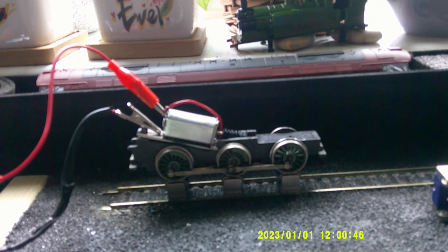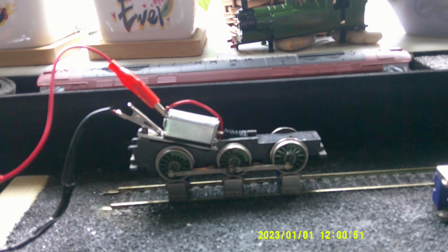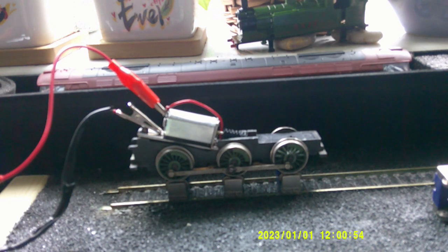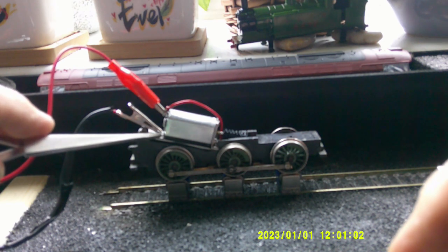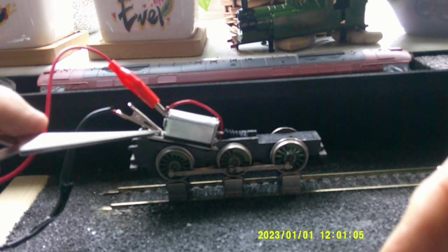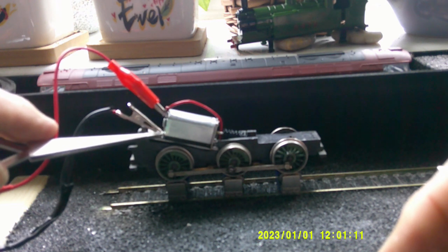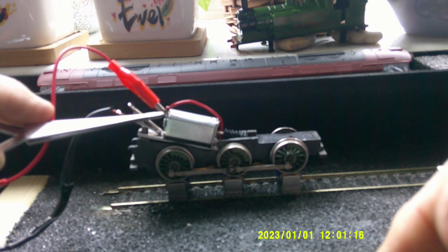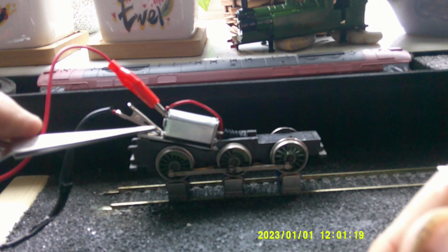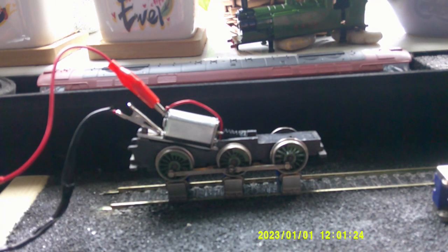I did get ahead of myself — I put it on the test track but forgot to switch the camera on. So I can already confirm I was wrong: that is not sending a negative through to that terminal, and I'm guessing it's because the L-bracket doesn't actually touch the chassis. I did cut off the top of it because I didn't like how close it got to the live side. So I've now wired this direct on to negative — let's turn it on and hope it works.